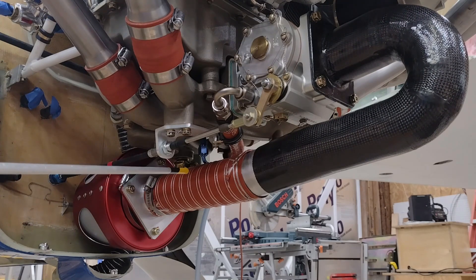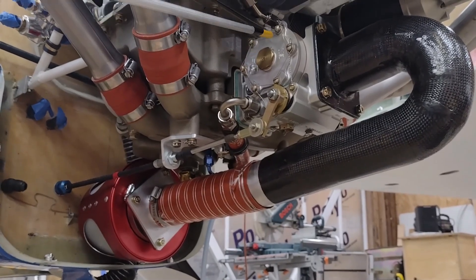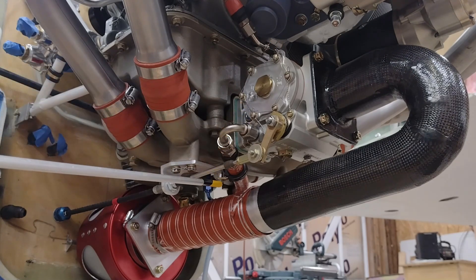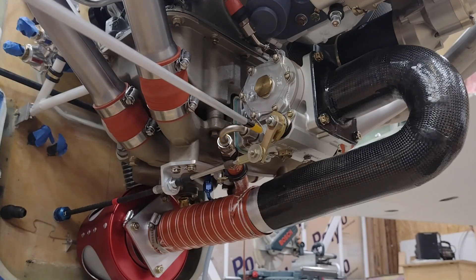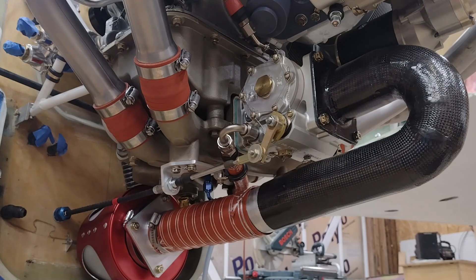With this facing forward, the two restricting factors were this sniffle valve right there, and on the top here this is the dash-4 quarter inch outlet where the fuel comes in through the main line, which comes all the way over from the right front side of the engine from the mechanical fuel pump and then has to come in on the left side. If I tried to take it in the other side, there was interference with the throttle lever, so I would have had to get a completely different type of throttle lever for the servo. I had already switched the inlet from one side to the other and then had to switch it back.